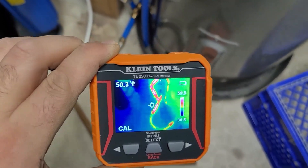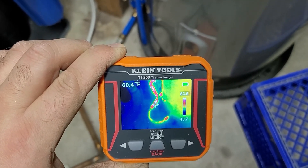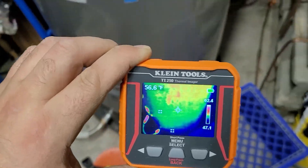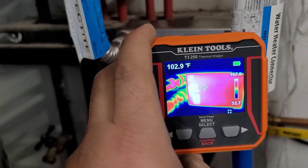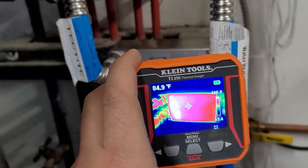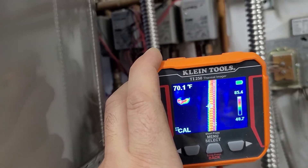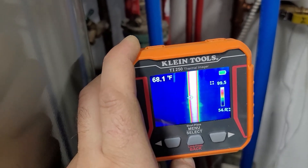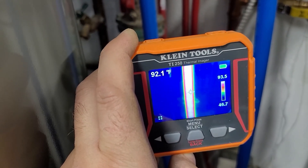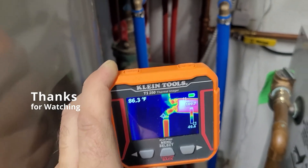It's going in there — pretty cool. I can see the temperature is 107 degrees going through the heat exchanger. I'm not able to get a good reading on the pipes as it keeps changing, but at least the concept is working. It's better than 40 degrees — it's reading 102, so it's going to take some time.